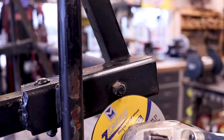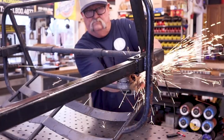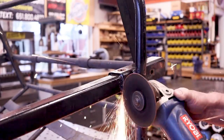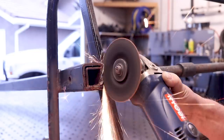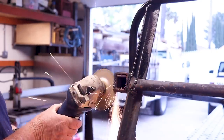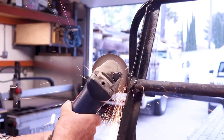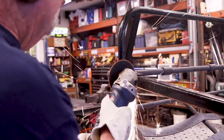One of the first things the customer asked for is if this could be detachable — it could come apart. So the first thing I'm going to do is separate the chair from the frame itself. Whoever had this before, the mountain resort, had welded it together on the bottom and the top. I've grabbed a cut-off wheel and I'm cutting the welds off, cutting the bolts off, and getting this thing separated. You might notice I'm using some new abrasives here from Mercer Industries — more about them coming up.